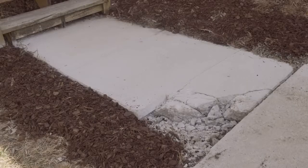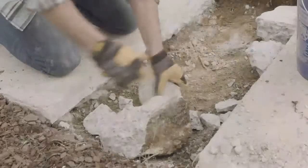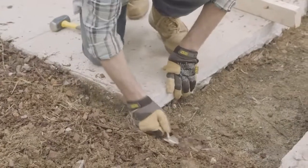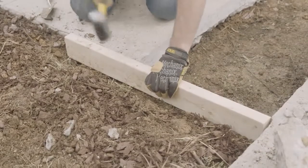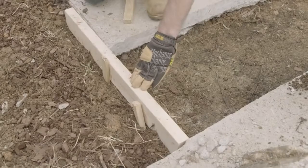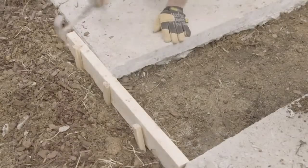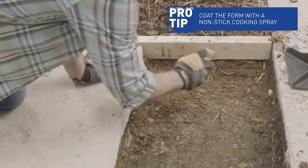When a piece of your sidewalk is too damaged to use, it can be best to just rip it out and start over. First, remove the existing sidewalk piece. Once the piece is gone, clear any rocks or debris from under the spot where you will put the new slab. Dig around the edges to create a perimeter, then it's time to build a form. You want the top edge of the form to be even with the existing sidewalk so it all sits flush. Use stakes or scrap wood to hold your form in place, placing stakes regularly to avoid the form from blowing outward. Make sure the stakes sit below the top edge of the form, or else cut them flush.